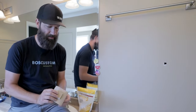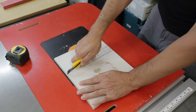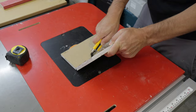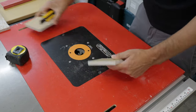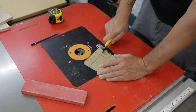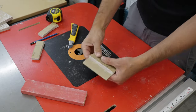With the California patch, the best bet is to make it ahead of time — make it slightly bigger than the hole. To make the patch, you basically cut it to size from the front. You want about an inch and a quarter of paper overlapping. Cut it to size from the front of the board, snap it off. Now flip the patch over, mark it out, cut it from the back side, snap it. It peels off surprisingly easy — just peel the drywall off and it'll leave the paper behind.